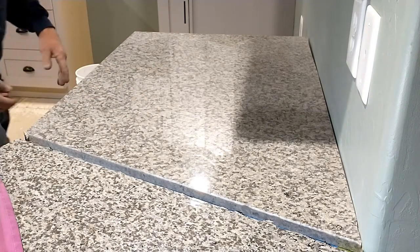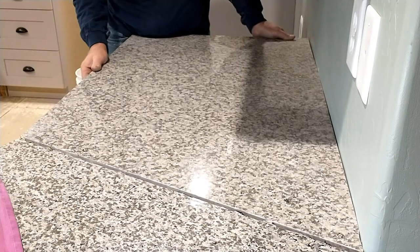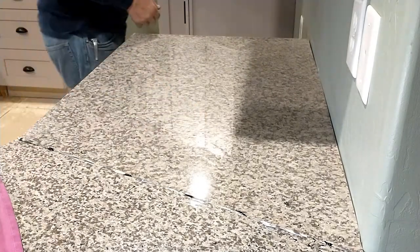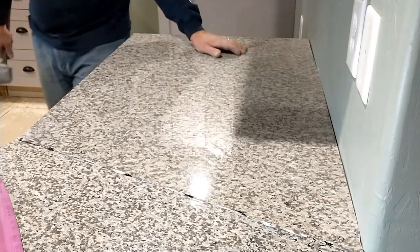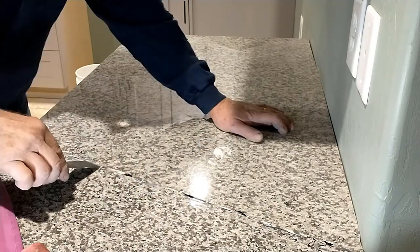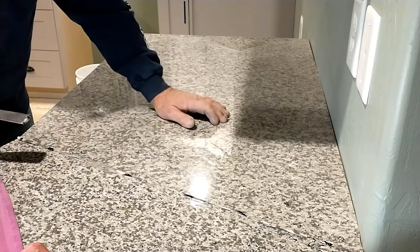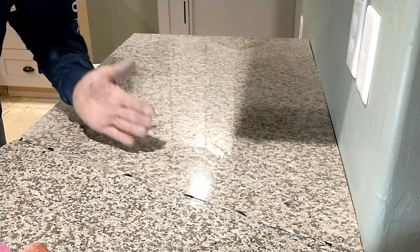And then with that, I'm going to get the material up on my tape, slide it in, and let it all push out along the length of the seam. I'm looking along there, making sure the crack is all filled up. You want it kind of above initially. It looks pretty good. You can see it in the video, but it's all sitting above.